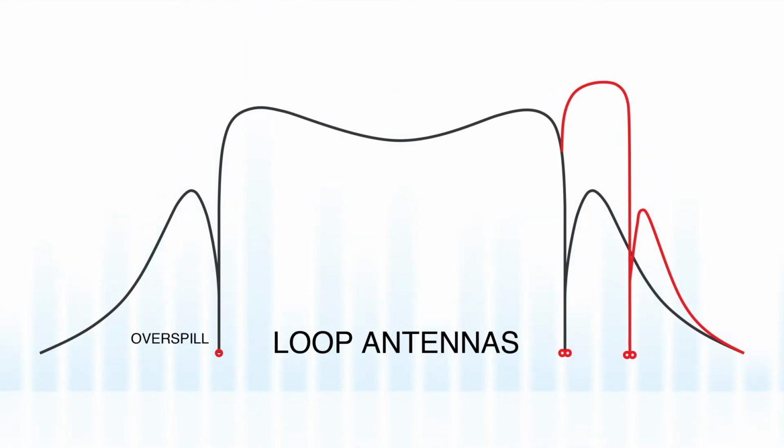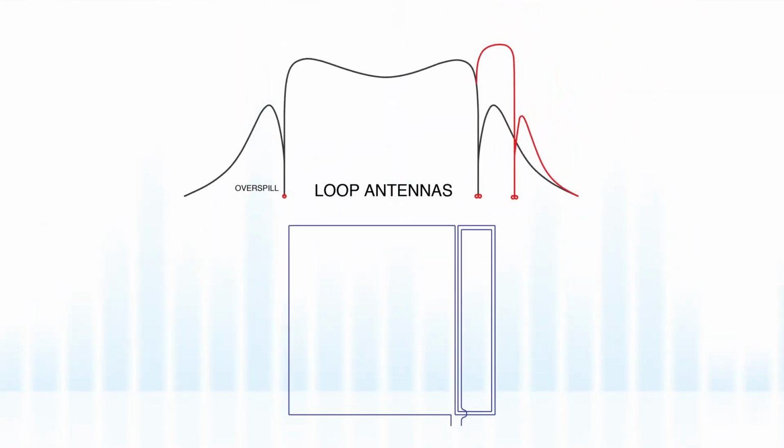The smaller size of the primary creates a little less spill, and the spill is moved away from the edge to accommodate the small 2-turn loop. The stronger 2-turn loop along the edge creates the illusion of a partition as illustrated in the image. The functional reality of this configuration has less appeal than the illusion. The signal is distorted by creating a second loop along the edge. It will be difficult to use a T-coil in this area.